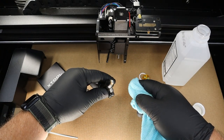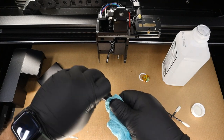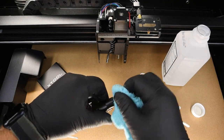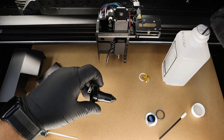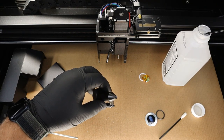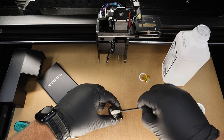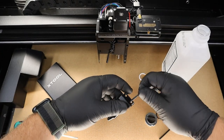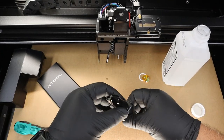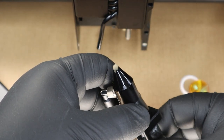First thing first, let's clean this really dirty looking nozzle. I've got a microfiber cloth — I'm going to take off as much of the debris and junk as I can by hand. Now I'm going to switch over to the alcohol swab, dip it in the jug, and start scrubbing the tip of it. I'll also put the swab down inside the middle, spin it around, push all the way to the tip, and swirl it to make sure I get it nice and clean.